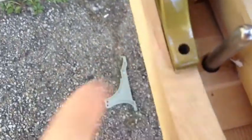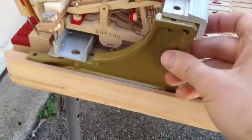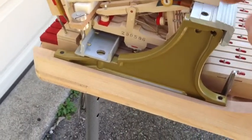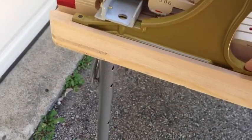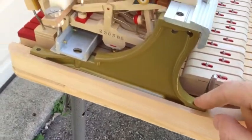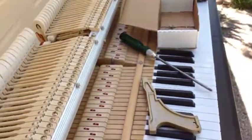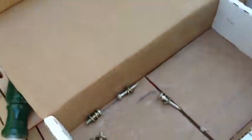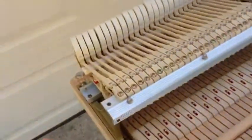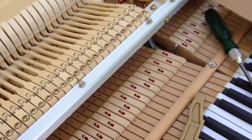I check and make sure the holes are the same — I'll check there with my flashlight. Looks like they are, and usually on these ends they are the same. In the middle you might have to move them. Then I'll rough back in these screws just slightly. I probably won't put the ones back in the action frame right now, but you can do that. Just screw everything in just a slight bit, and I'm going to go down to each one of these brackets and do the same thing until I have them all back in.